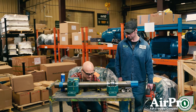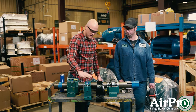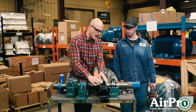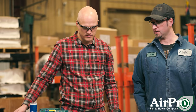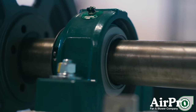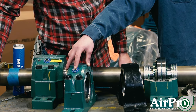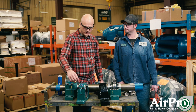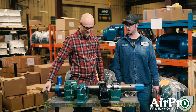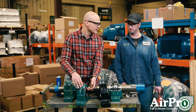Regarding other bearing types — this one is an imperial style with an open side, and this one is a ball bearing style. How would you pre-fill these bearings? These come from the factory with some grease in them, but there is a chart we follow. We take the gun, push it onto the Zerk, and put the necessary amount of lube in there according to the chart. On these, you can actually grease them until grease comes out the seals.